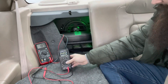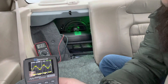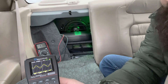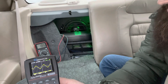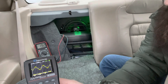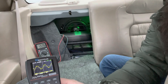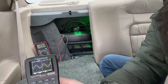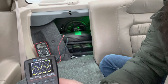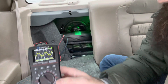You can watch right there — as it slowly goes up, it'll start getting fuzzy. That's on the clip, so that's clipping. A little bit of fuzziness on the top. As you go more, there you see it goes flat — that's a hard clip. And as we go a little bit higher, it starts getting that weird sawtooth pattern. So let's turn our gain down.